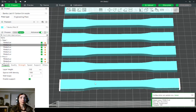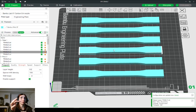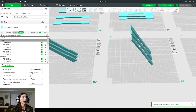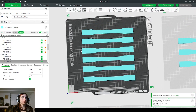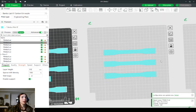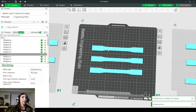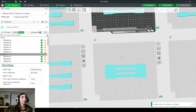The warping was made worse because each sample was 100% solid infill, concentrating so much hot material in localized spots on the build plate. The concentrated heat in the center caused the build plate to warp around the corners. When printing at different orientations using supports, the supports actually help dissipate residual heat and make the build plate less prone to warping. Rather than filling the build plate, I recommend printing part by part with a gap between them, so each layer has time to cool before the next one is laid on top.